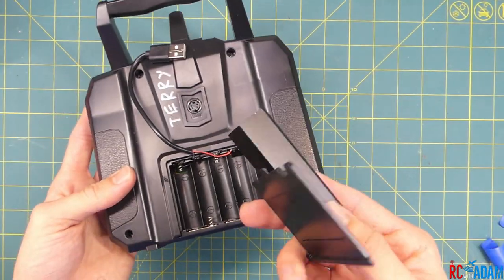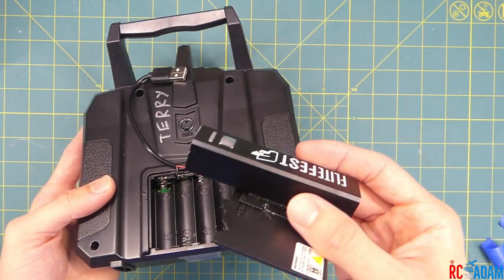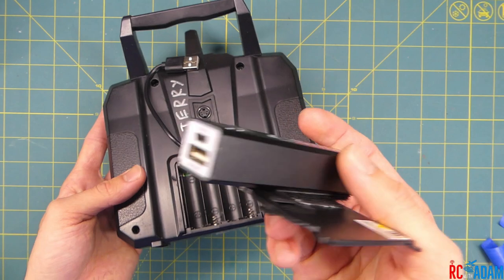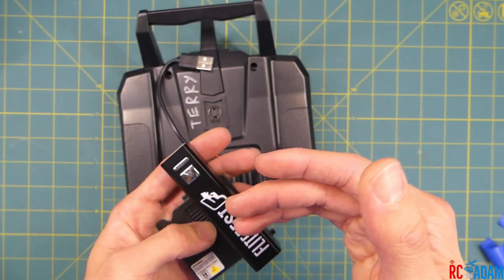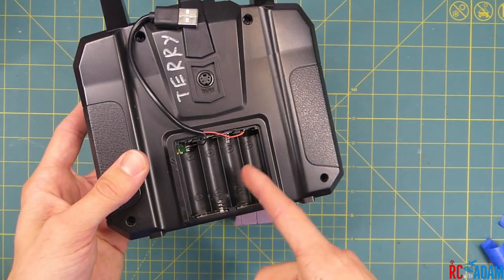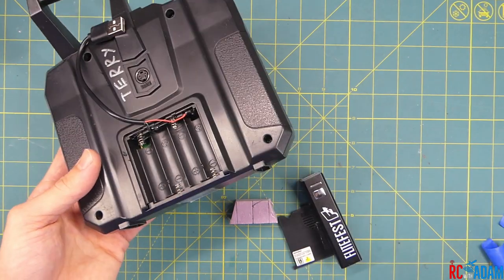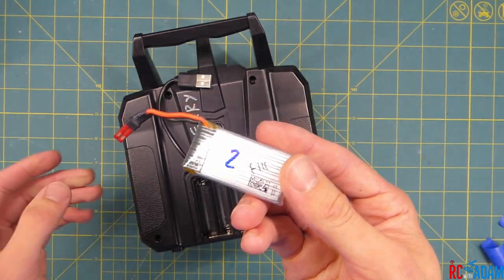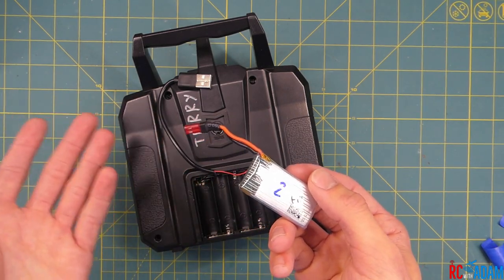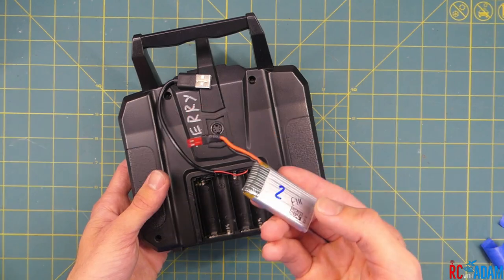Now you might be thinking, well that's kind of hodgepodge — why do it like that when I've seen other people do it better? That's true. I've also seen people doing a similar idea with a phone charger battery, which is a lithium battery — so you get better run time and better performance in hot and cold weather. They'll put it inside the case, or hack out a spot in the battery compartment, or remove the battery compartment. Or they'll use a lithium polymer battery — like a single cell — and step up the voltage to around 5 volts, which is pretty efficient. Or they might use a 2-cell at around 7.4 volts and step down the voltage, which would be less efficient.